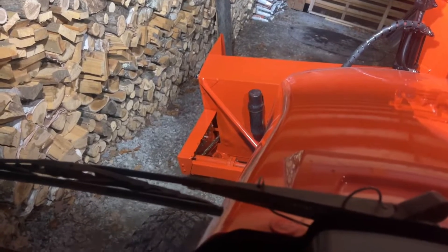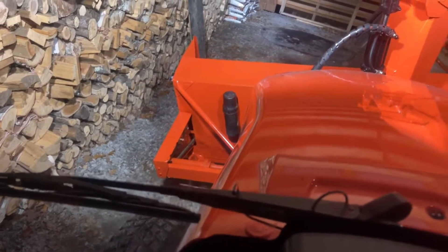All right, moment of truth — let's see if it works. We should be able to see the chain rotate. There we go, we're up and running! Well everyone, thank you for watching. I hope this helps you get your L6060 up and running. Ours just stopped one day — I went to turn the PTO switch and it wouldn't start. I pulled it apart, freed up the solenoid with a little 12-volt zapping and tapping, got it working temporarily, put it back together until the part came in, and thought I'd make this video to help everyone else. I hope it was straightforward, and yes I did put the zip tie on that wire like factory. Thanks for watching and stay tuned for more Kubota videos.